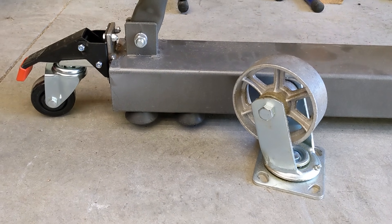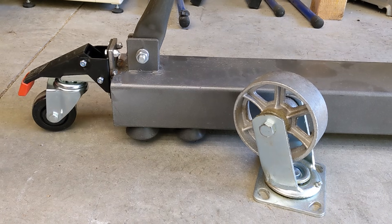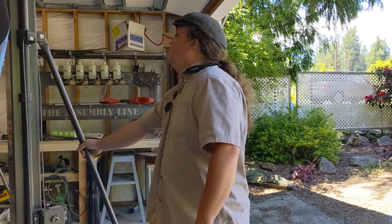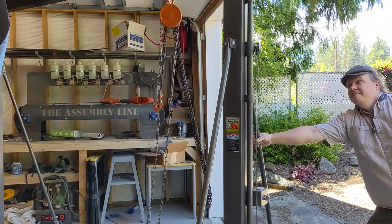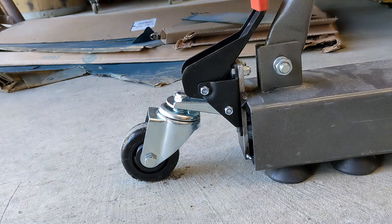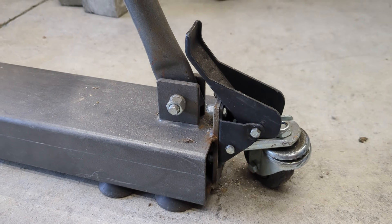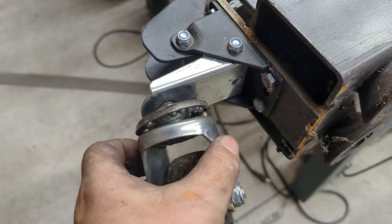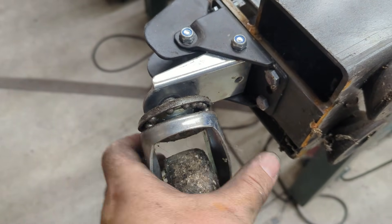So four years ago, I replaced the original metal casters with retractable ones. They aren't rated to hold much weight, but I also added high strength rubber feet underneath. The idea was that I could use the casters to roll the crane around to where it was needed — including outside, because it was now short enough to get out under the garage door. Then once it was in place, I could drop the retractable casters and it would sit securely on the rubber feet. This worked great, except in practice I rarely remembered that last step. I'd get caught up in the heat of the moment, usually with the added time pressure of a rental truck that needs to be returned, and I'd lift the load without dropping it off the casters. This put more weight on them than they were ever designed to handle, progressively warping them more and more over the years. The outer shop became littered with ball bearings that dropped out of their twisted, misaligned races. It had gotten to the point that they barely worked at all anymore.